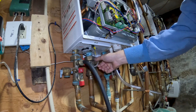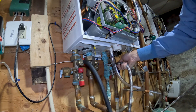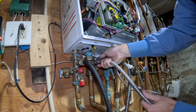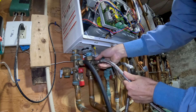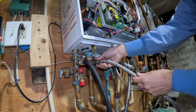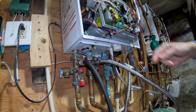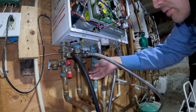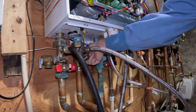Right now the unit was actually running. They just had hot water go into their radiant heating. But their recirculation pump is super hot right now, so I don't want to touch it. What I'm going to do is flush it out with some cold water on the cold water side. So what I'm doing here is shutting off the main large valves on the hot water heater side and the house heating side.